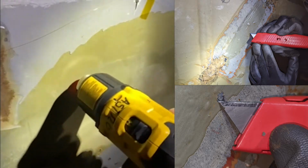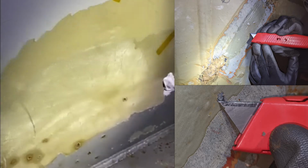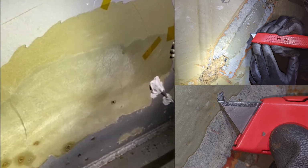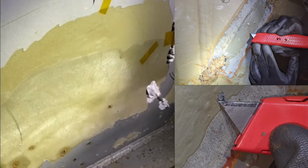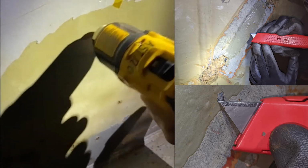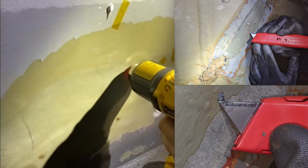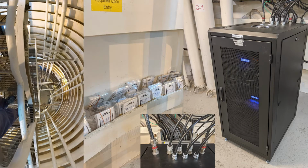One of the things we saw on the right is that the initial install had some bubbling, and that was likely due to some of the moisture that was on the surface during the installation. And that was affecting some of the sensors, especially when the bubble happened right at the sensor location. So we used passivation with phosphoric acid, and then also drove off the humidity from the sensor locations before installing. We also instrumented with additional types of sensors, plate and regular standard sensors.